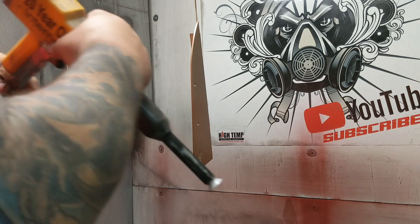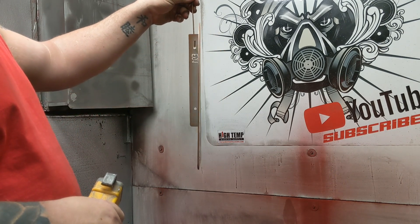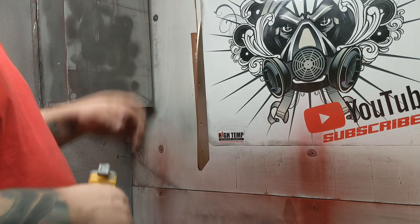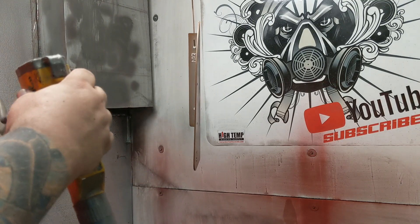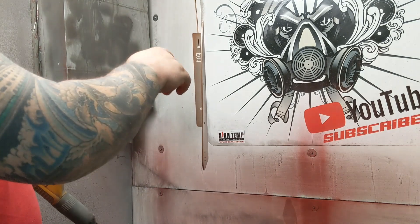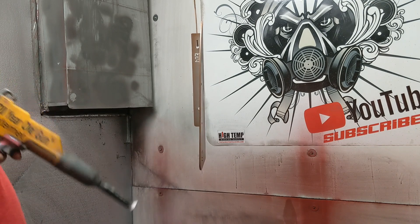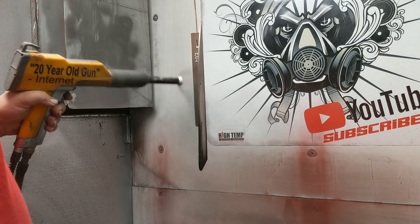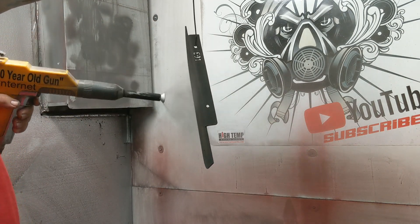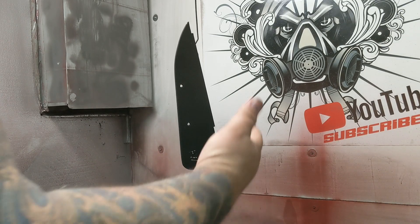Now we've got this first piece up to show you. This is the fireside copper on the very edge of this diffuser. We sanded all the visible edges to make sure they were nice and smooth because otherwise they had all these weird grooves in them. Now we're throwing on Ford tuxedo black — this is from Prismatic, a match to Ford's tuxedo black color. Shooting this at 45 kV with the dual coat extended tip, just because it's going over powder that's already there. It's just a gloss metallic black — definitely my go-to for metallic black.